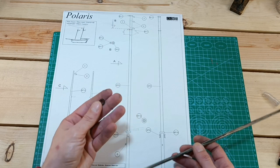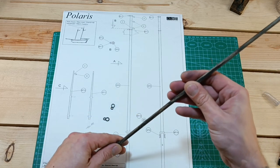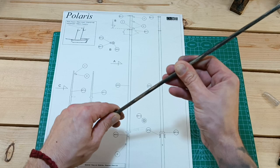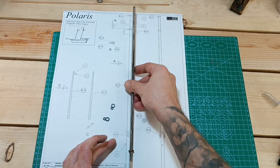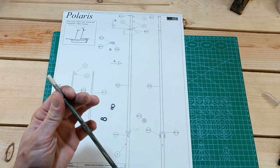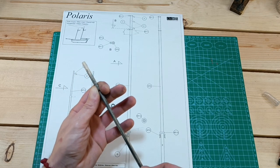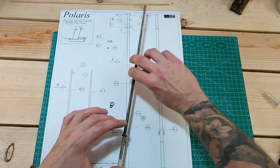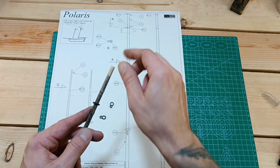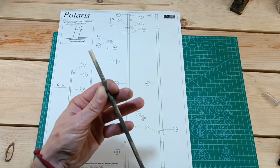I will not glue, for example, this ring, because it enters very, very hard. I don't need to glue this part. And when you're doing this, when you put it in, be careful not to split it. It's a gentle one. We need to go right here, very slowly. We go to the position where it needs to be. Higher, and as you can see, it did damage our wood a little bit, not damage exactly. So I will give it a little bit more sanding. This is again one of the reasons why I don't stain it immediately.